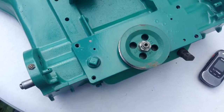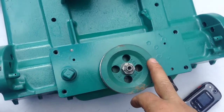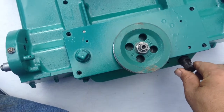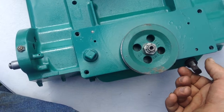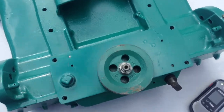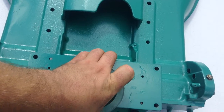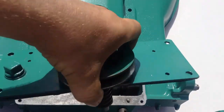Alright, this is my Ward's Master Quality rotary mower. Now, the way the self-propelled works, this is your input pulley for the trans. This shifts in and out for the clutch. Nothing's all together yet, because I'm putting it together, but I'm also doing a little show and tell, showing you how the thing works a little bit. So let me get this off.